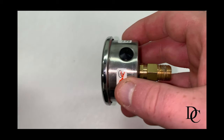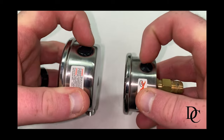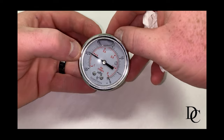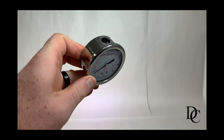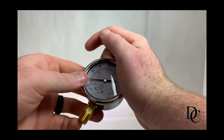Plug 1 and 2. Most gauges have either a flat or rubber-pointed plug attached to the side of the wall of the gauge's body. These are both vented in the exact same way, equalizing the pressure by venting the cap. Simply place a fingernail underneath the side of the cap and apply pressure. This allows the pressure, whether it be over or under zero, to reset itself back to the resting position at zero PSI.